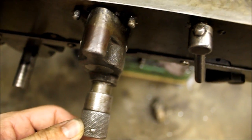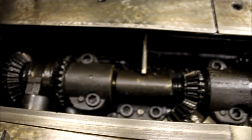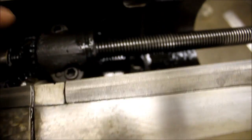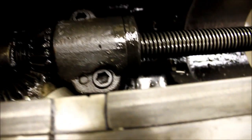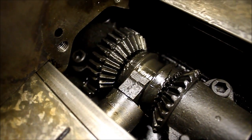This bit right here engages the directions of the power feed — that's to run the table to the left. It actually doesn't want to engage right there — there we go. And that engages it to the right. Left, right, left, right, and then neutral. The lead screw has a milled key that runs the length of the shaft, and that's what these gears engage. On this side, this is just the gear that transfers power off of the power feed — it's actually freewheeling, it's not keyed. And so is this gear.